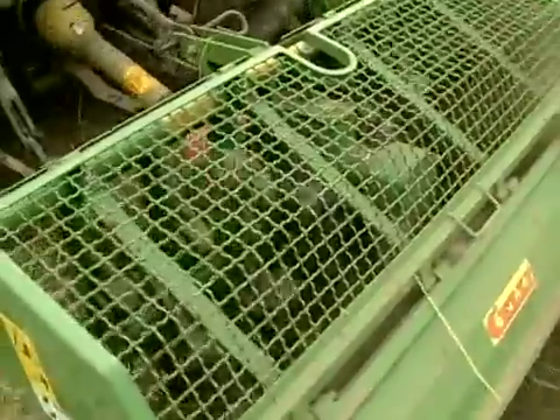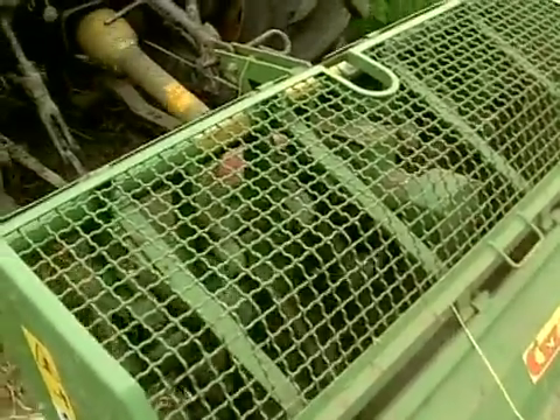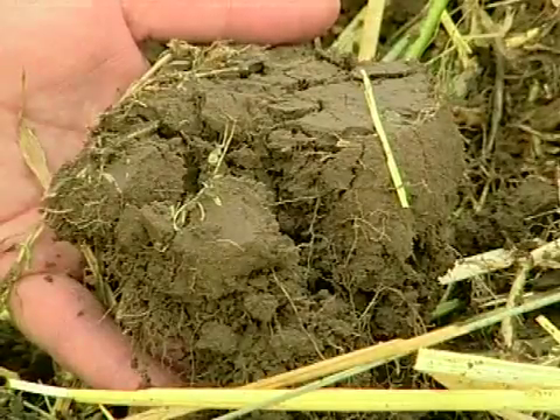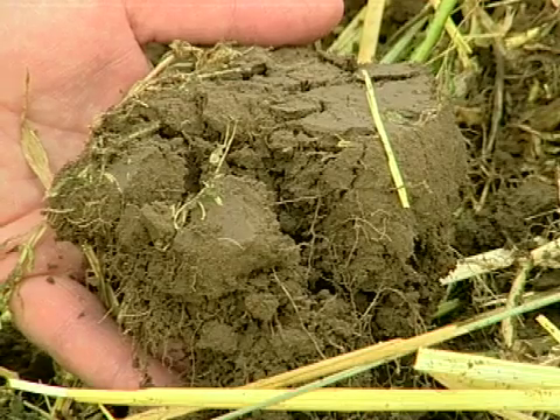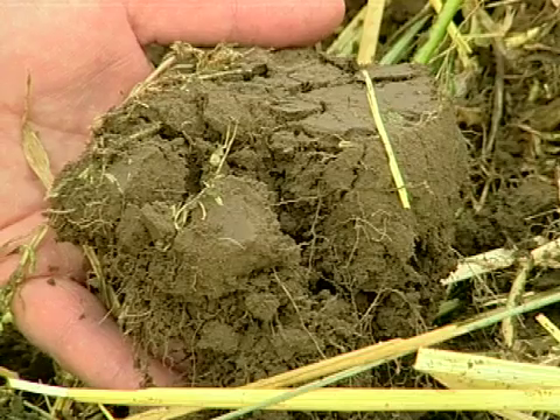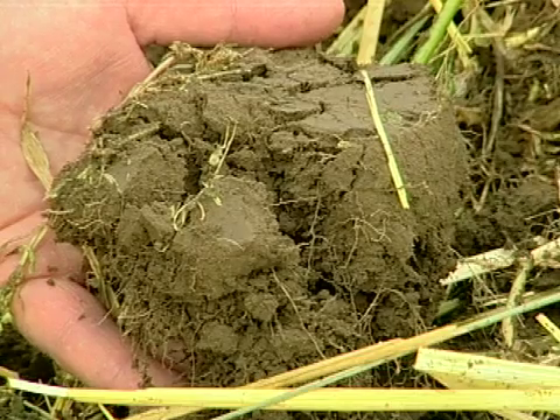It's like a number of shovels and just cuts clods. It does a good job of chopping the straw into the soil, but you get nice clods and over time they can break down slowly, so it's much gentler on your soil structure and it doesn't oxidize all that organic matter you're trying to bring into the soil.